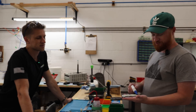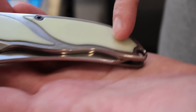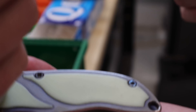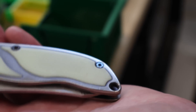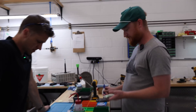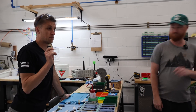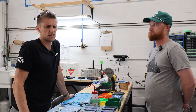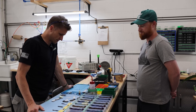One last thing about the Black Max versus the tape: with something like Moonglow, which is a more transparent material, you can actually see a little bit of the Black Max peeking through. So hopefully the tape wouldn't have any of that result at all — we could use more transparent materials without a black smudge underneath. Apparently this is what Chris Reeve Knives uses for their inlays — some sort of VHB tape. Skye mentioned that whenever customers try to remove a Chris Reeve inlay, they always end up breaking the inlay, which can't be fun. That's kind of where we got the idea. We've been tuned on the idea for years and just finally made it happen.